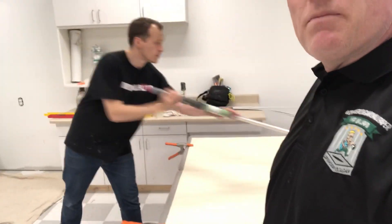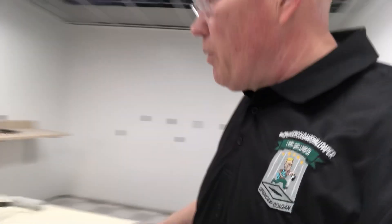Now, this is what most of us are doing when we don't want to bring out the pasting machine and we're willing to spend the extra time that it takes. If you have a pasting machine, you just pull the goods through the machine and the thing is glued — theoretically anyway, unless your machine skips, in which case you just use your brush to put the glue on in the missing spots. But rolling is a very efficient way.